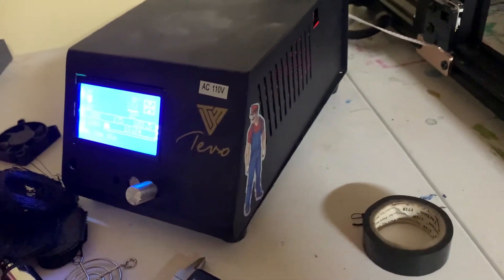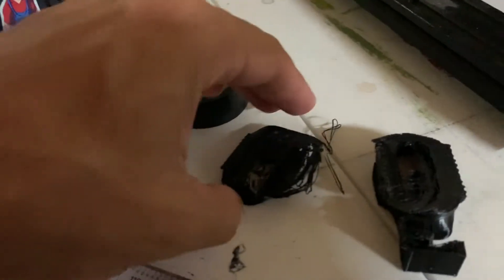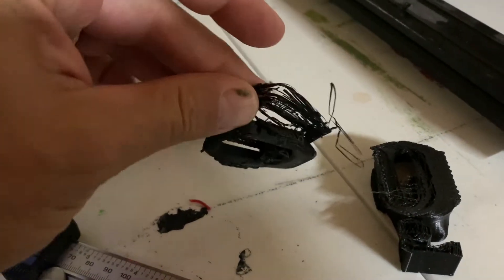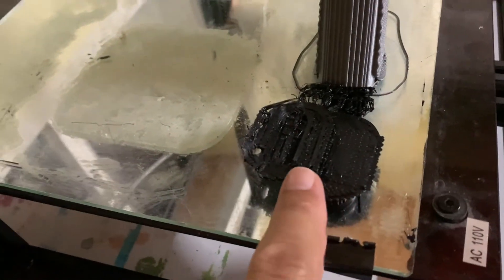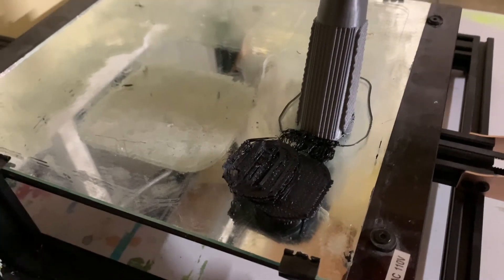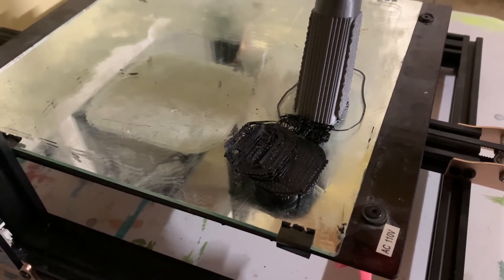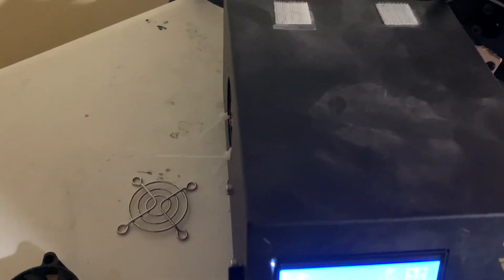There you go - the layer shift was caused by a bad fan in the electronics case. Check all those fans out. I've also seen that happen a lot with a clog in the hot end fan. Temporary fix to that problem. There's some really bad layer shift you can see here - the way it just started drifting and shifting the layers over, that's what happens. Quick tip, quick fix - glad it's going again. Now waiting for that new fan to come in, get the right size one mounted properly with the guard on, get this thing back in full service.